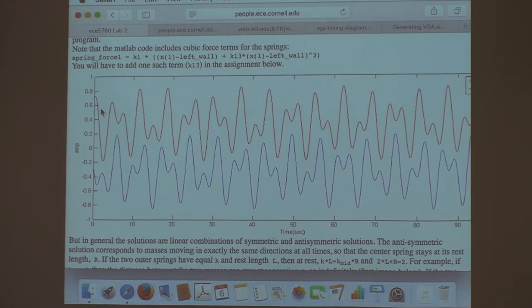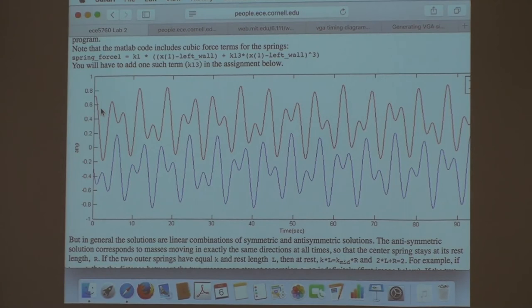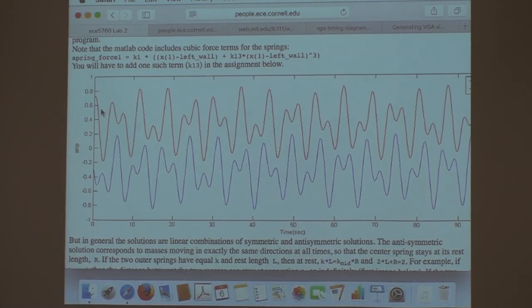So the simulator is going to be running at something like a step size of 2 to the minus 9, which means it's going to take about 2 to the 9th steps to produce 1 radian of output. So it's going to take about 6.2 times 2 to the 9th time steps to do 1 cycle. And you are surely not going to want to write 3,000 points during that time. You're going to want to write 20 points.